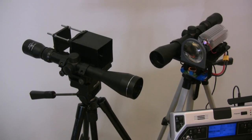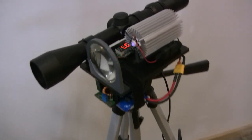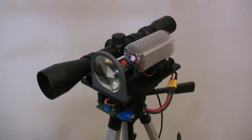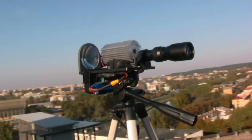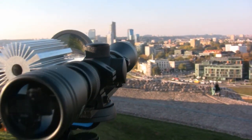This is the first prototype of such an alternative control system. An optical transmitter is connected to a remote control. This is an infrared emitter — a collimator that generates an invisible light beam. The collimator lens is adjustable to provide either wide-angle or long-distance control. The device is mounted on a tripod with a telescopic sight.